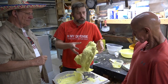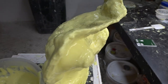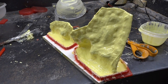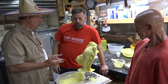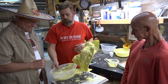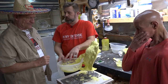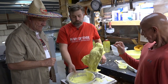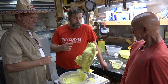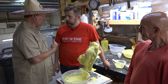Later on we'll be able to get a wax mold out of that. Right now there's clay — the original clay sculpture is on the inside. Do you have to wear any equipment to keep from getting sick? Not at this stage — this is all pretty benign stuff, it's just rubber, put together with a liquid rubber and a catalyst. So right now there's clay in there, you split it open, get the clay out, pour wax in, and that creates the wax mold.